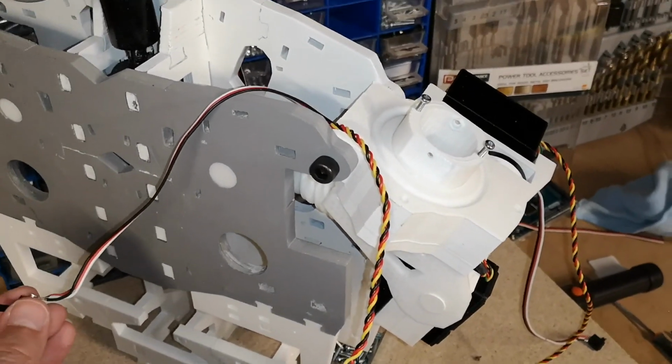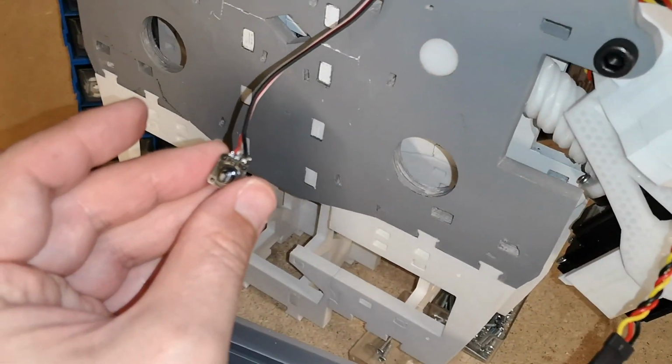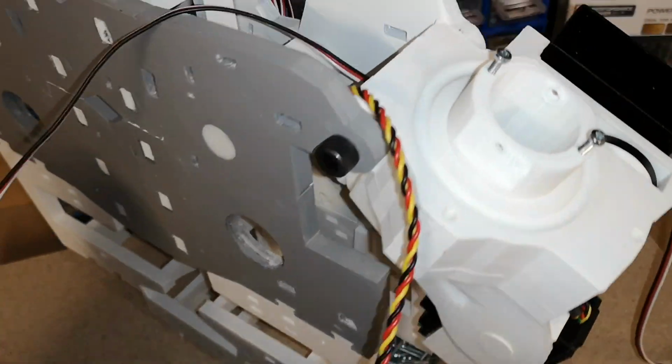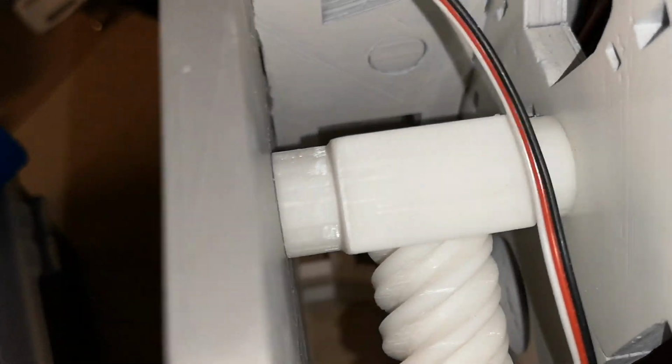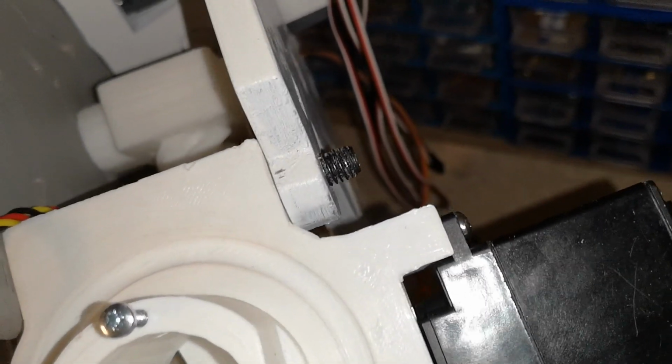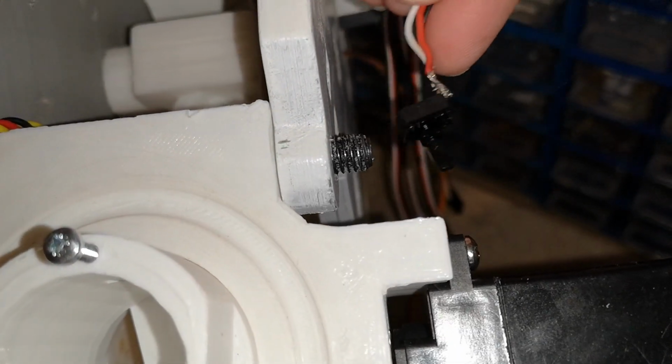I've just stopped it there. It's still powered on. I've just found the dead center of the potentiometer to stop the servo. You can just see down in there, you can see the piston is starting to recess into the piston base, so if you went too far it would just come right out of the block. I guess there'll be some other limits once we get the potentiometer mounted on the back here.